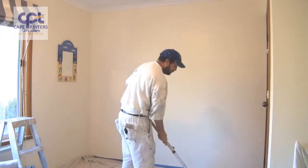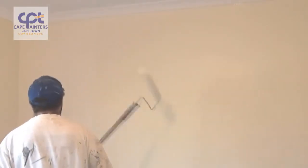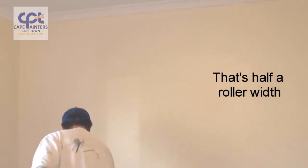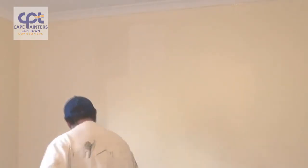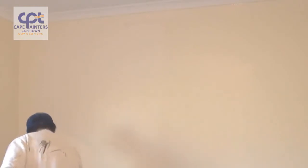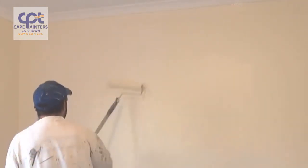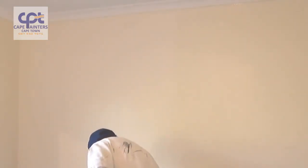Now that's sort of rolled out, but I'll actually do one more dip. Once again, I'll start roughly a roller width away from where I've just rolled. I'll spread the paint out a little bit and then spread the paint back into what I've just rolled. As the paint gets less and less, that's when you can roll right up to the top and right down to the bottom.